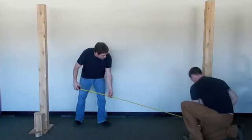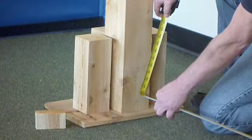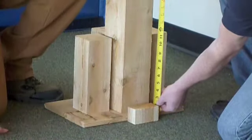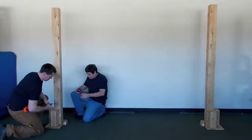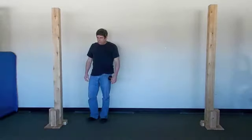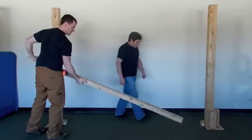When installing your first panel, always ensure that your posts are 96 inches inside to inside. Use a 2-inch piece of wood to run over your post hole that you can set your bottom rail on. This 2-inch gap will help you for trimming and other landscaping purposes.